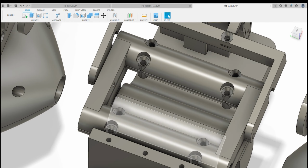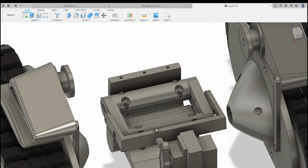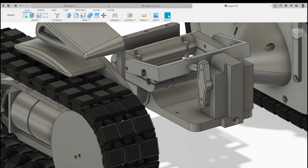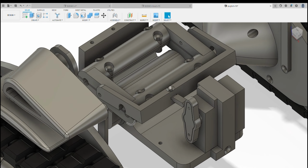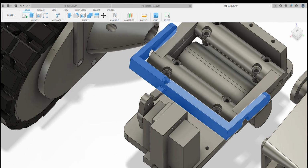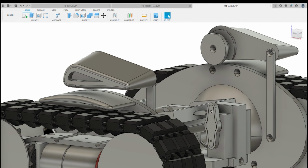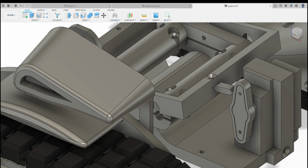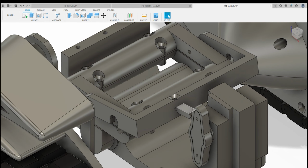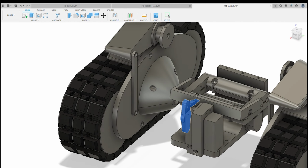Then what you do is put the upper frame on top, and again you've got four bolt holes. These clamp the M6 bar to the main mechanism, and then it's got a pivot, so where those bearings are, it gives you this pivot. And then there's this servo tilt arm which sits on top, a couple of screws either side, again M3 screws just to hold that on. Effectively, when this servo goes back and forth a tiny bit, it tilts the whole body by 10 degrees back and forth, and this little servo horn here is printed in flex, and then there's a servo bracket that holds that in.